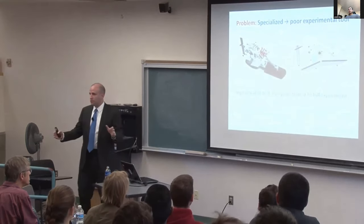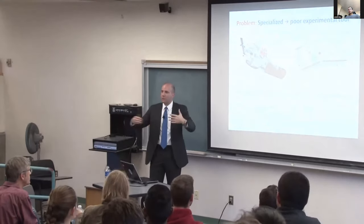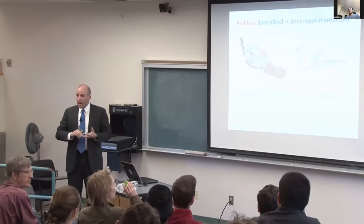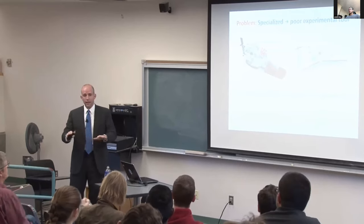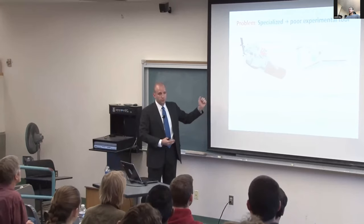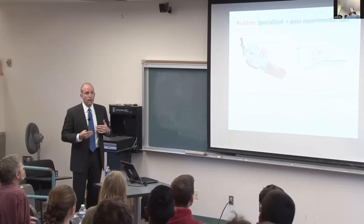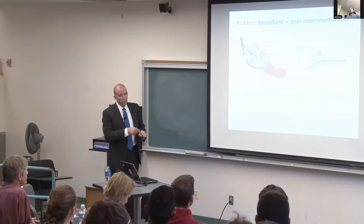If we go back and look at the two devices we compared in our study, you'll see that there are many such differences, right? This is a Seattle Lightfoot, a very commonly used prosthesis. And this is our energy recycling foot. There are differences in keel length and stiffness, damping properties, a dozen other features that could be responsible for the observed changes in high-level performance. So worst of all, after our experiment, we don't even know whether energy recycling is beneficial, right? We haven't performed a controlled test of whether that functionality is beneficial to people.